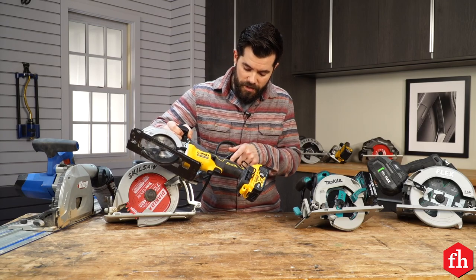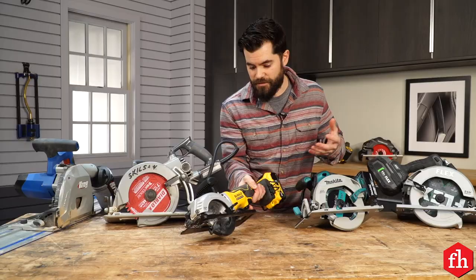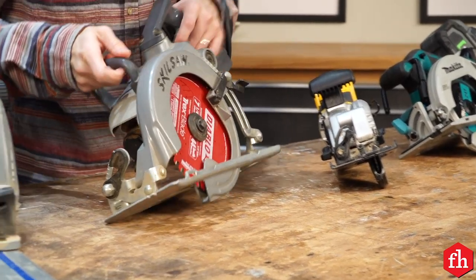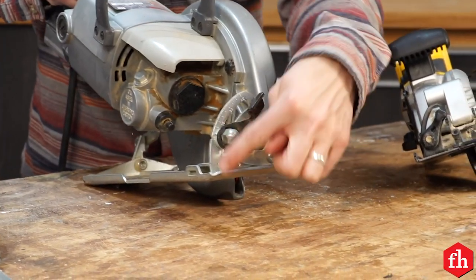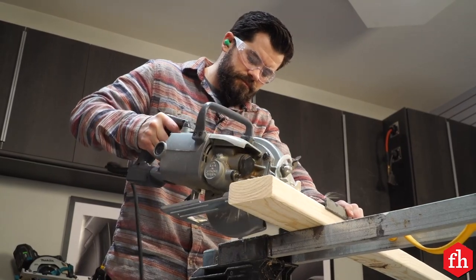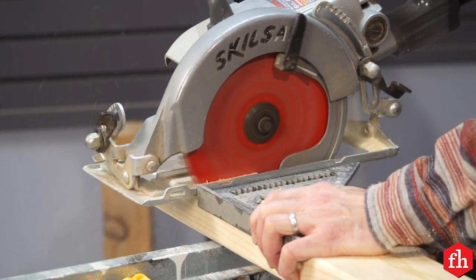The shape of the flooring saw is a little bit different — it's got a barrel grip, which makes it really nice to push behind and gives you nice straight cuts, a lot easier. Then we've got the gear-driven saw. This one is a worm drive. It's got a narrower shoe and it's a lot longer, and these are very, very powerful because of the way the gears are driven. It makes it a lot easier to cut straight because of the length.